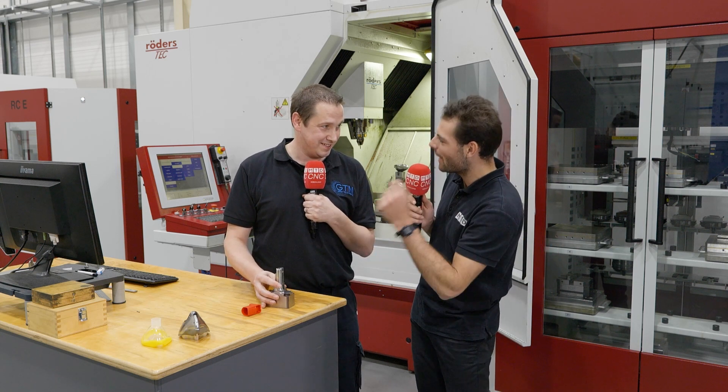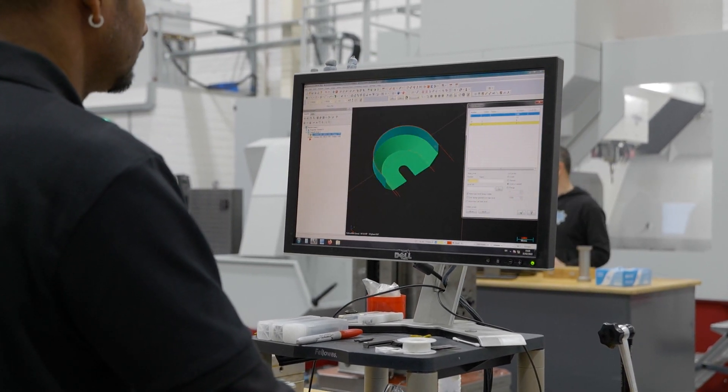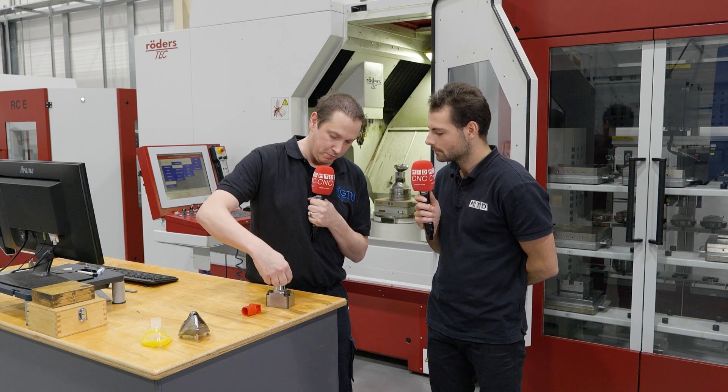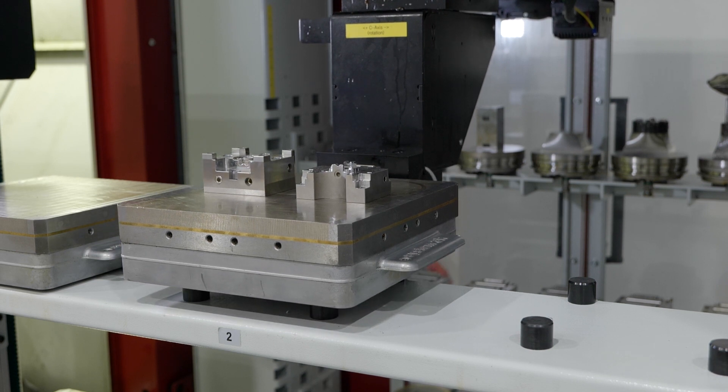Can you dig in and tell me what exactly is a shut face? It's where two pieces of steel come together and you have the end of your molding area. So this would be your shut around the bottom here — your plastic would mold down to here, and your steel stripper goes around the outside and stops the plastic.